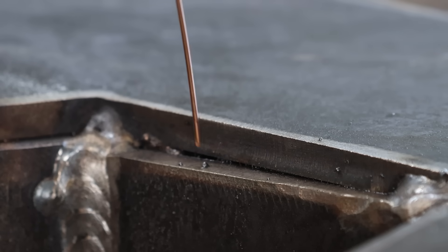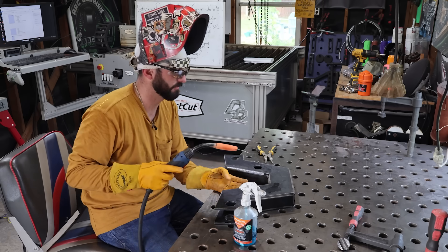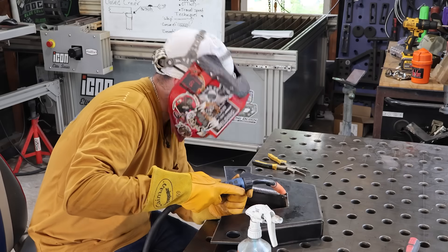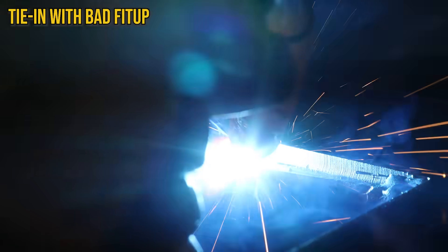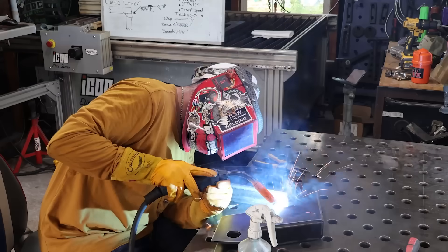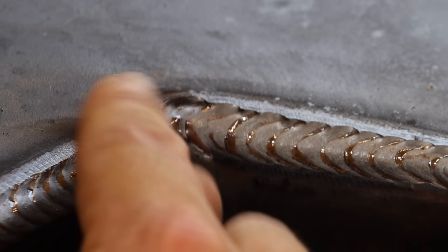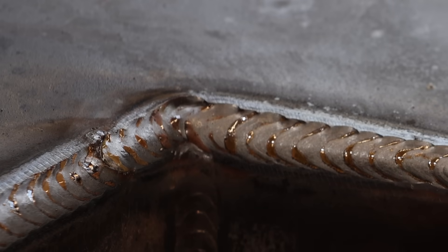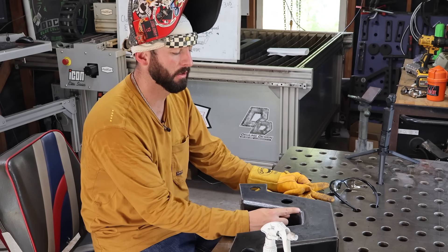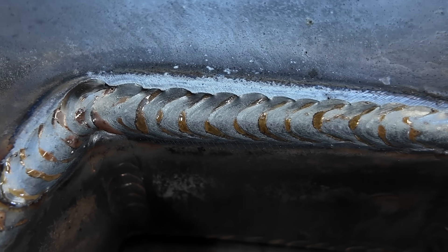We have a lot of room right in here to make fillet weld, but as we progress, the bottom edge starts to disappear and we still have that higher top edge — which is not a great combination for a 2F weld. Then we run into a bunch of tacks, so no room for our weld whatsoever before we get back on track. Looking at the bead profile, the tie-in looks pretty clean. But as we change angle, there's so much room there because that plate's out — it has even more filling to do in this corner. You can see we're underfilled with a tinge of undercut.